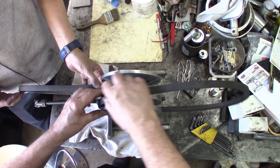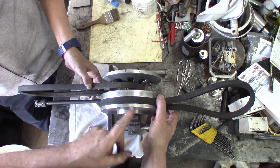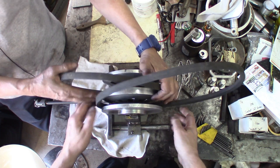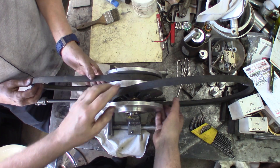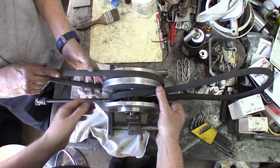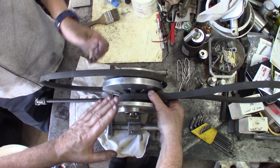The ratio — it's a little bit awkward to hold without being mounted — but see, this pulley is very big there, very small there. So if you've got, say, six inches there and three inches there, you've got a ratio of two times the speed. If you want to go the other direction, you raise the pulley and it goes this direction, so you get a small pulley on one side and a large pulley on the other. At maximum, you've got a few inches there and six inches there, so the ratio goes the other direction. Pretty simple, pretty efficient.